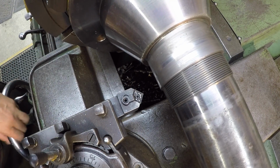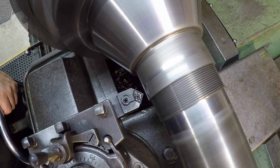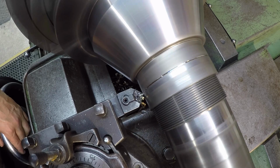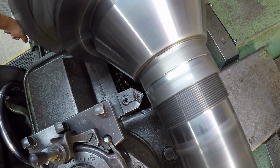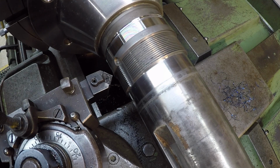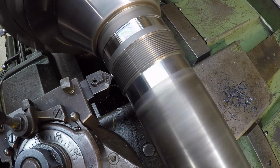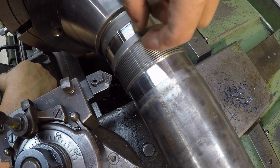We're going to use this tool here, this MCHNN, and I want to try to get an idea on how deep that sleeve is. Let's just come right here in the middle somewhere. I'm going to set a 0. Well, that's already 50 thousandths right there, so I may be mistaken on a sleeve. This could be just rolled over, the metal rolled over that far. That might be all it is that the journal is just worn so bad that it just rolled over.